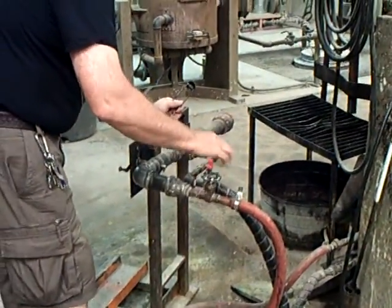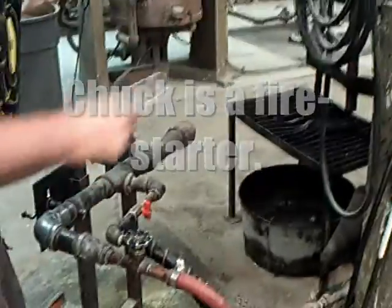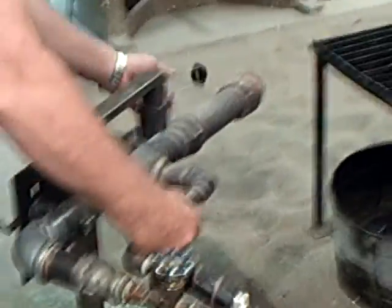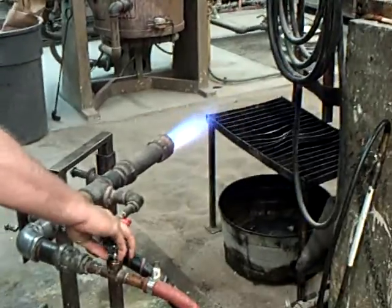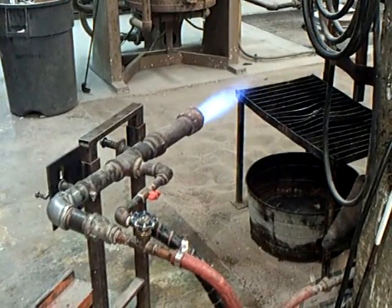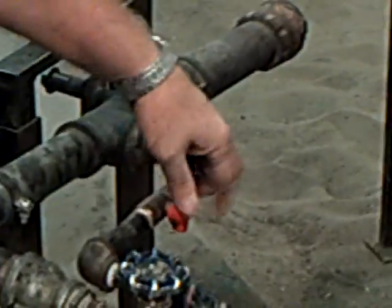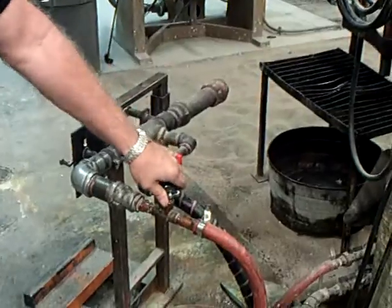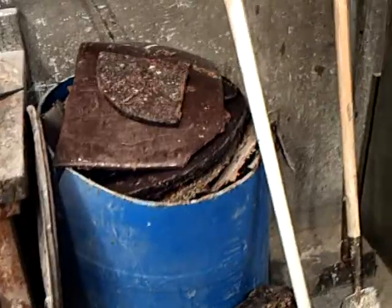So you guys are already done. Put the gas on. You gotta use a good one. You're gonna turn your air off — that's what takes the wax off. That's about 1800 degrees coming out of there. And all the wax gets collected into foam water and we recycle it. That's what this is — all wax to recycle. So we never throw the wax away.